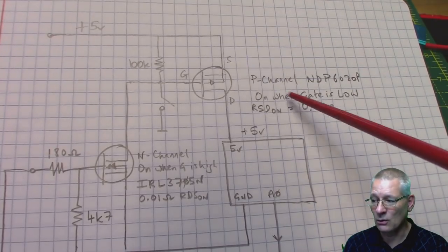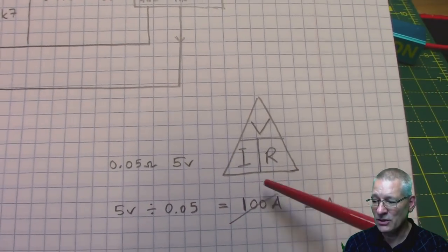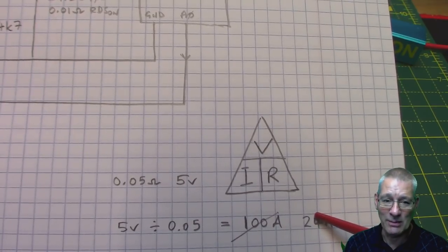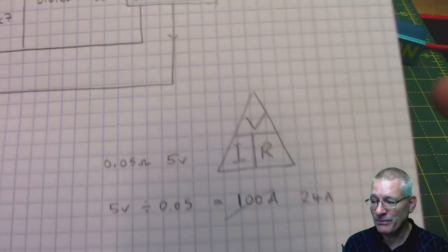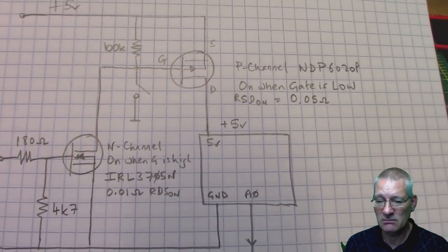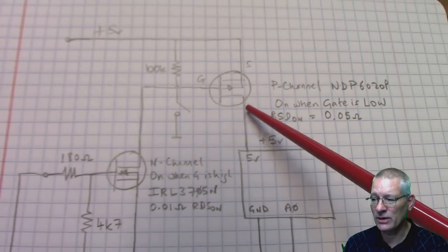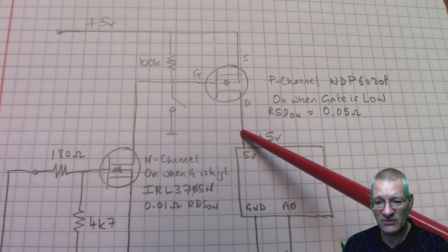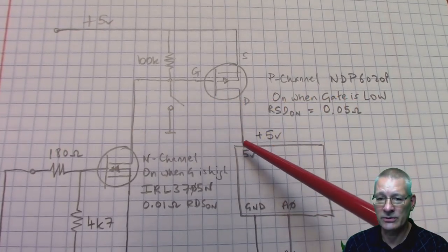The first thing the Arduino does — in fact the only thing in my sketch, but the first thing in any sketch — is set the GPIO pin high, which turns the N-channel MOSFET fully on, which keeps the gate of the P-channel MOSFET connected to ground. Now, the reason I said I don't think we needed the MOSFET here — I used it because that's the one I was playing with at the time. You could probably use an NPN transistor, but using a MOSFET absolutely guarantees it'll be pulled to ground, because the on-resistance at five volts is 0.01 ohms.